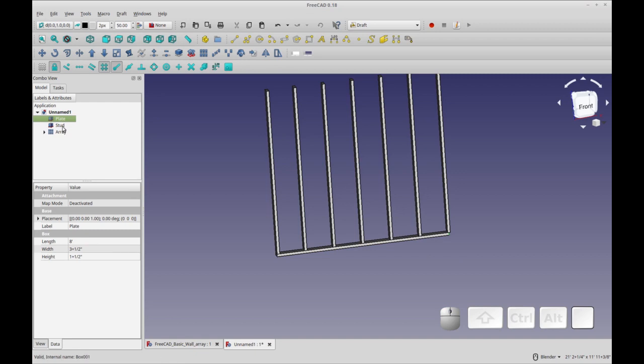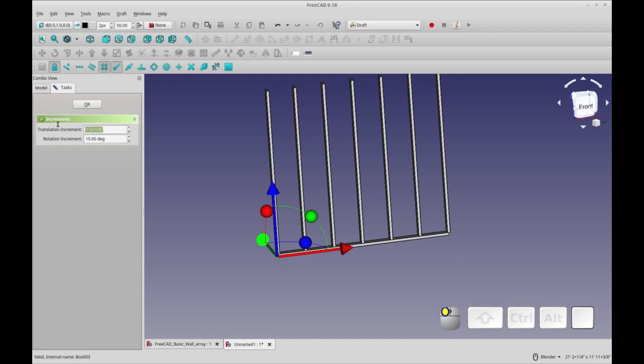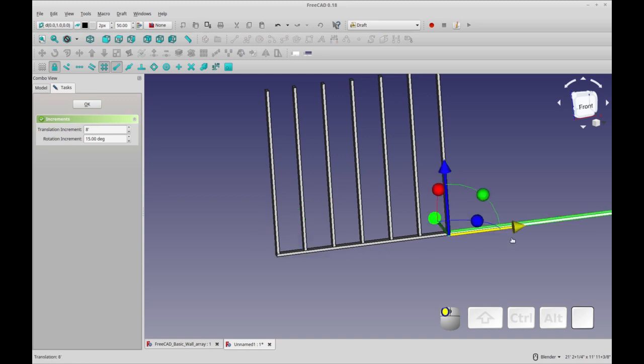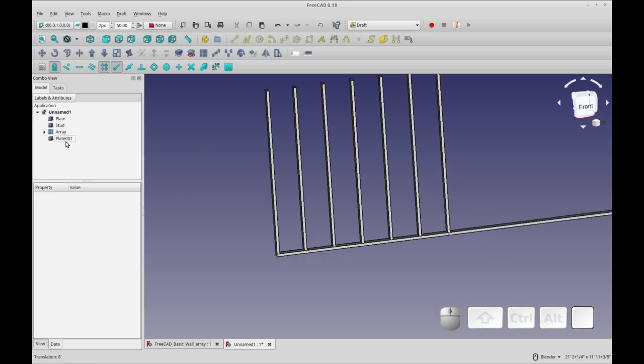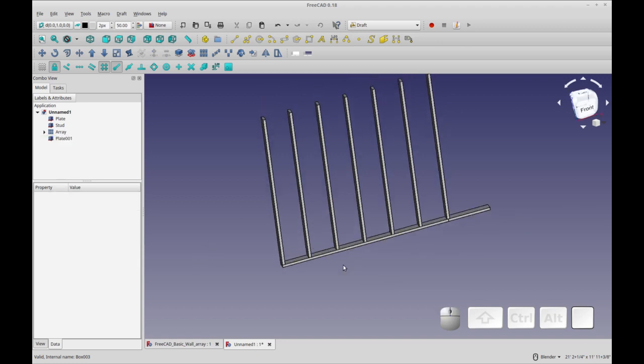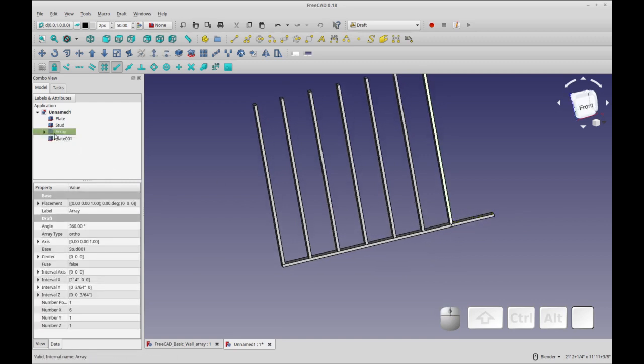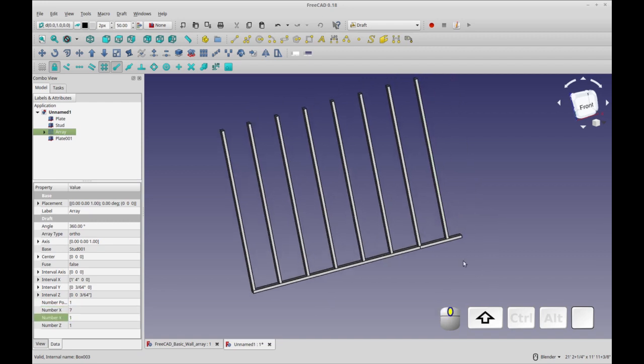We still have to add two feet to our plate. Notice that the last stud ends right on the end of this plate — that's what you want. Let's copy this plate, transform it eight feet, and then change it to a two-foot section. The plate will eventually be the full length of the shed and we'll add a measurement to that later. I think our array should have one more stud, so let's add one — that's the beauty of parametric modeling.